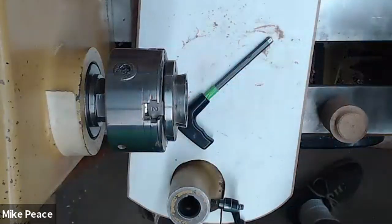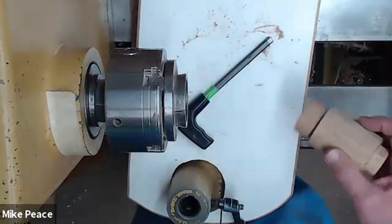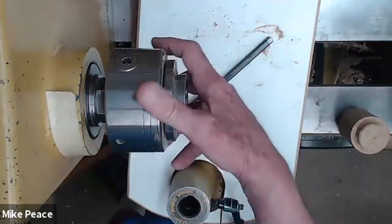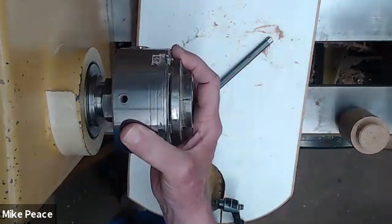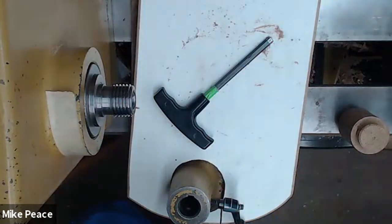I like the Nova and the Record Power and the Patriot normal jaws because they call for a parallel tenon, and a parallel tenon is, to me, faster and easier than a dovetail on a tenon. I understand the need for a dovetail recess, because almost all recesses, with the exception of the One-Way Talon, which uses a parallel on the inside and the outside, use a dovetail.